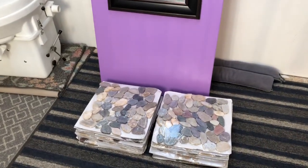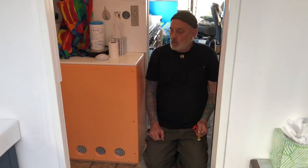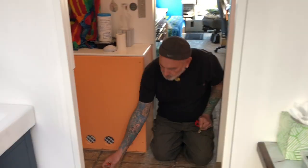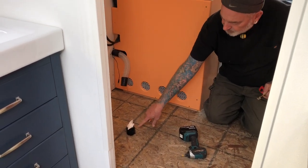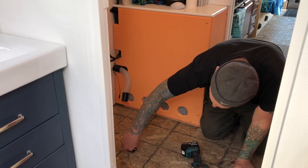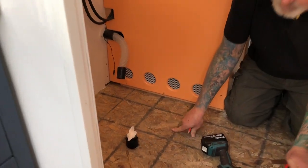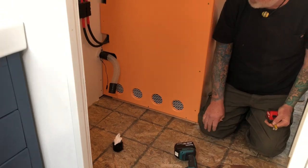Here are the rocks we're gonna lay. When I put the toilet in I knew we'd be adding subfloor, backer board, and tile, so I left slack in the pipe below — it goes into a rubber connector. All I've got to do is go below, unhook it from that connector, and I can put the backer board down, drill the hole, and put it back through.